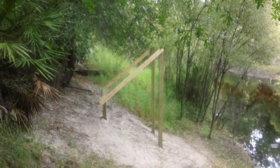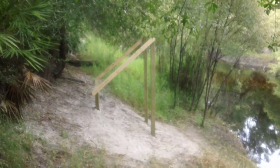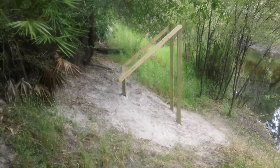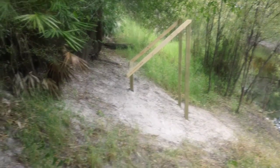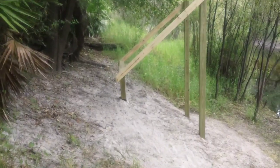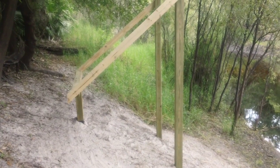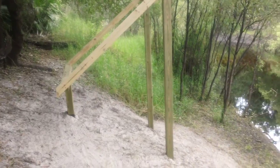Here is the beginning of the dock. It consists of four or three posts — two in the front and a T-post in the back — and they were sunk 30 to 34 inches into the ground. It came out pretty good. The gap you see between the left side and the right side, about two feet back from the two front posts, will be the terminating post at the beginning of the dock — the north side — and then it will proceed down from there.